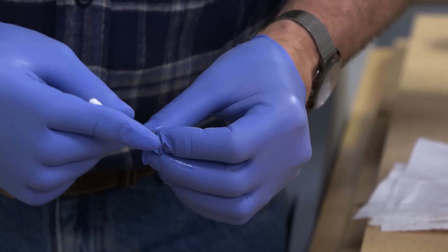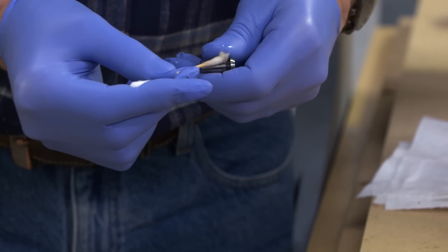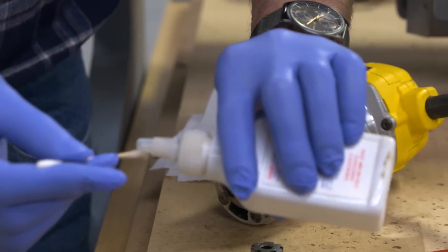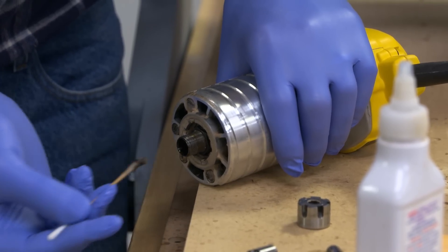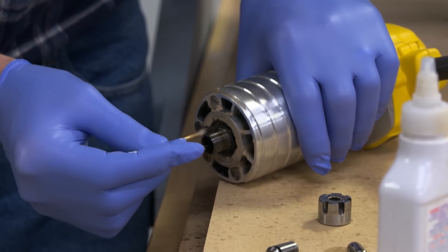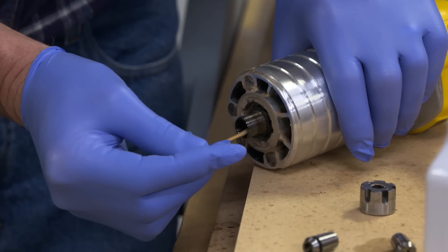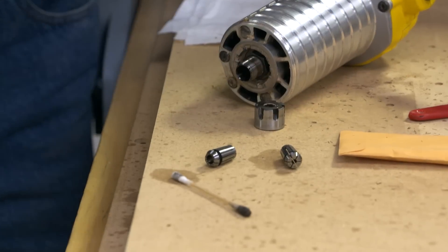The 1/4-inch collet is a little easier to get down inside. I want to go around the exterior and make sure everything is nice and clean, and get any dust trapped within the slots that divide the collet. Equally important is getting up into the router itself because dirt really does tend to cake inside the shaft area — you can see my Q-tip is coming out pretty black. Make sure the threads are very clean too. If you need to use a brush, please use nylon or brass bristles, not steel, because score marks in metal provide places where more dirt gets trapped.